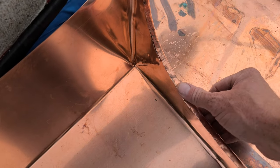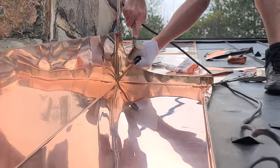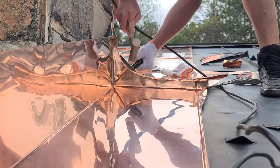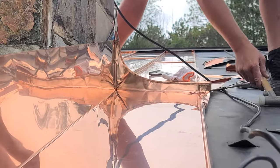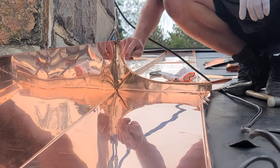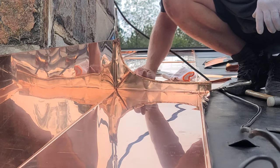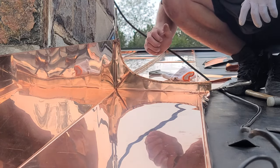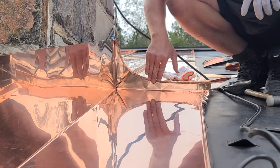We have that turned over — you can see some of those marks there. That's the metal stretching. All I want to do now is turn this over, making sure it goes over all the layers of the metal. I just think with this technique you're not necessarily bending it — you're more trying to roll that edge around on top of that raw edge from this piece. So you're basically wrapping over the edge instead of how we normally think about these things where we make a line and we bend on the line. This is more like we're shaping the metal over the edge and rolling.